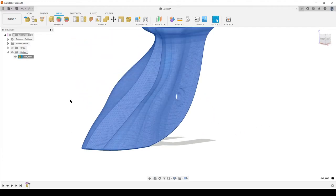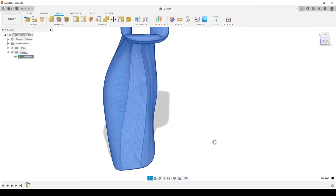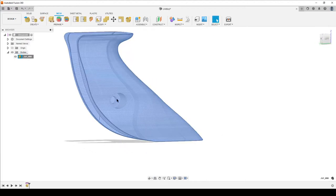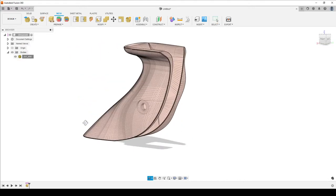We want to keep the curvature because this is a handle for a bow, and we don't want to destroy that nice shape. We simply want to move these holes two millimeters upwards. If the handle is around 100-120 millimeters in height, two millimeters is basically nothing. So here's how I would do it - step one, I want to get some geometry from this.